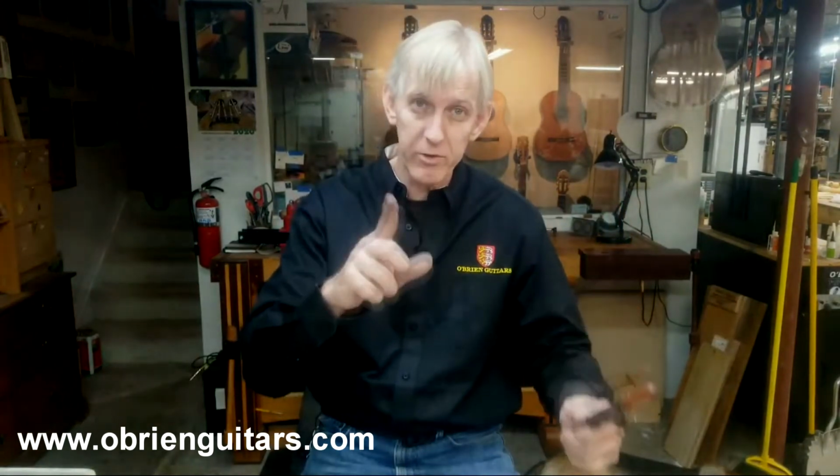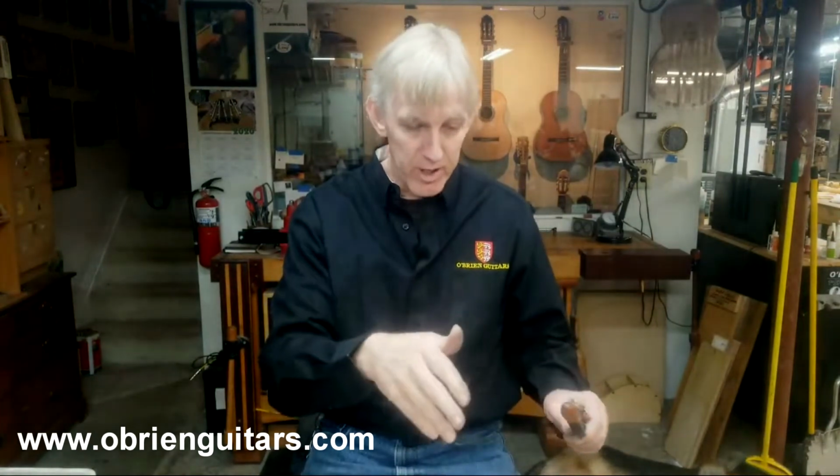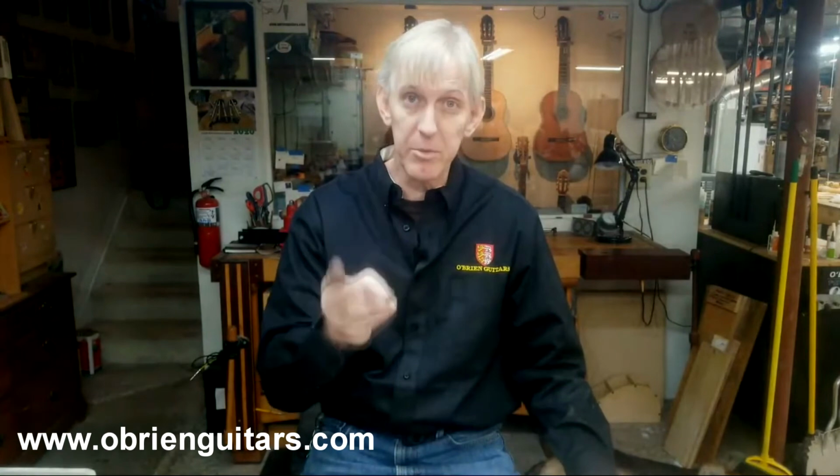Going back to the steps. Step number 1, flatten the back of the tool. Chisel, hand plane, spoke shave, whatever. Step number 2, primary bevel, and I showed you how to do that using the honing guide with a combination of diamond stones and water stones. And then step number 3, secondary bevel. That's where the rubber meets the road.